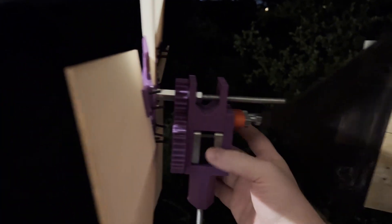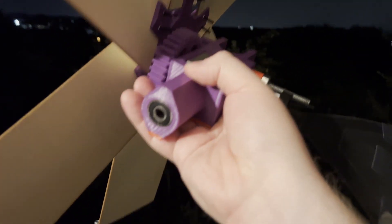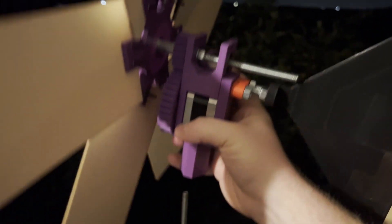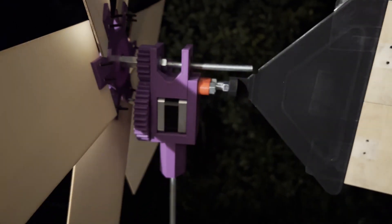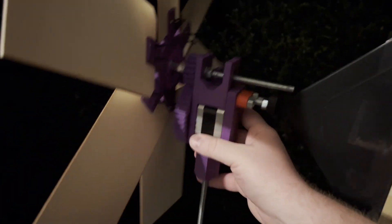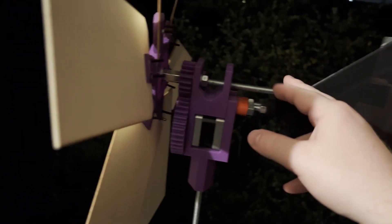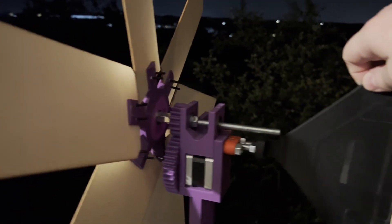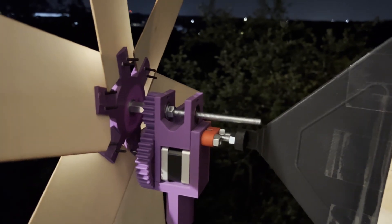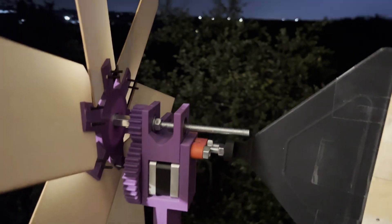One other thing I like about this design is that if you make these with enough distance between the mounts, you can fix it onto a shaft or pole without having to actually clamp anything down — it's firmly affixed and not going anywhere. This bolt down here is just held on with some blue Loctite. I found Loctite to be very helpful with these projects because I'm really scared of permanence — I'll go to great lengths just to save one bolt. With Loctite, if I decide I want the bolt or nut back, I can just get my heat gun out and salvage it.